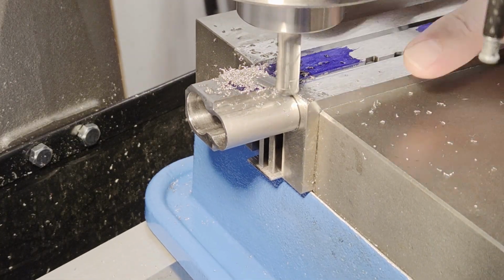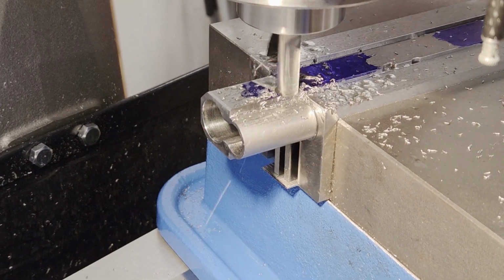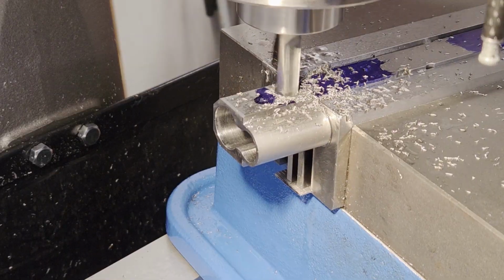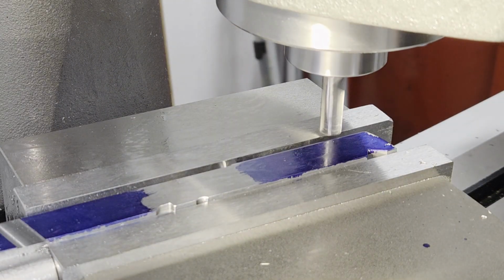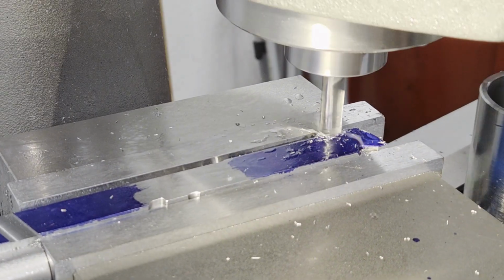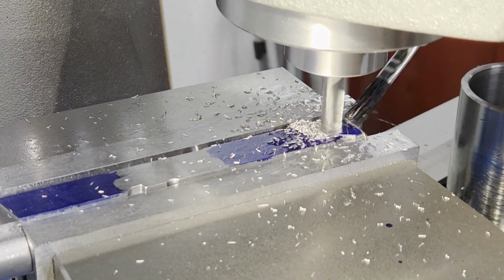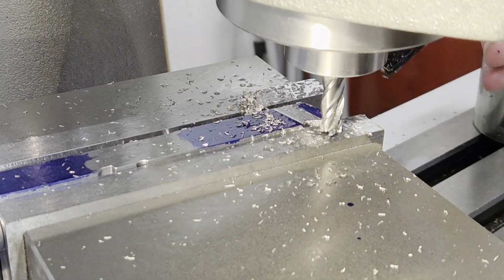It was cutting fine. My dad was the lube man. We don't have a coolant setup. He was doing good work. We figured we could take 30 thou depth in one pass and not end up with a terrible finish. With the 3/8 mill still installed, I traveled to the 3/8 wide rear cut location. I didn't need to zero my Z-axis again. The rear serrations are 20 thou deep, so I dialed that in and made the cut.